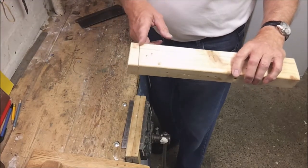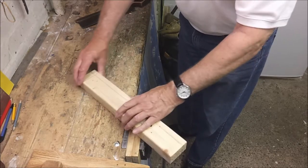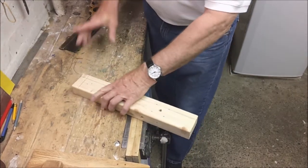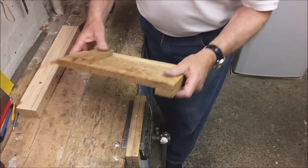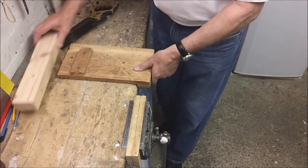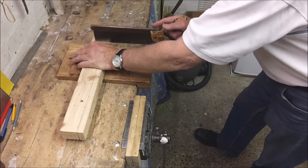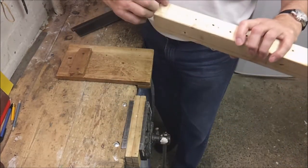When setting out to cut a piece of wood you need a firm surface like this workbench and you need something to stop the work piece sliding about. If I try and cut without any support the wood keeps moving about and I'm not cutting efficiently and probably won't cut accurately either. The solution is a bench hook — this piece of wood hooks on the bench, and this piece stops the work piece moving forward as I cut. If I push my hand against that and hold it in place, I can now cut very steadily, which means I should get a nice, accurate cut.